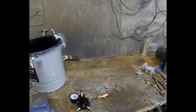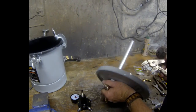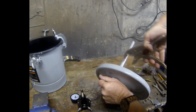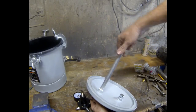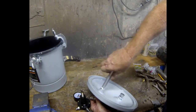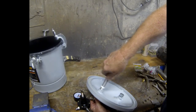The first thing I'm going to do is take off the straw. This is basically where the spray tank would suck up the paint — we don't need that; in fact, it would get in the way. It would bang into whatever molds we've got sitting in the bottom of that tank. So we're just going to unscrew that, and that straw or tube or pipe — whatever you want to call it — can be discarded.